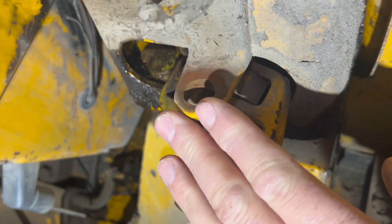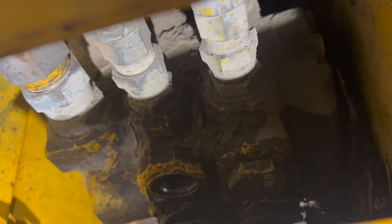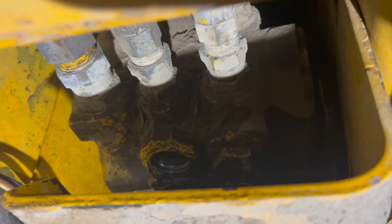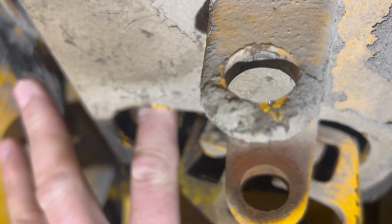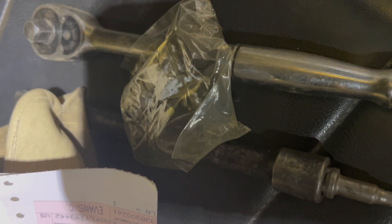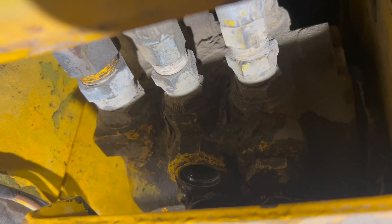Okay, so what I've done: there's the valve stack for the loader controls. I've had to kind of dismantle the linkage for the control system. There are like three bolts underneath there — can't see very well — but three bolts that bolt the stack to this heavy bracket. I just unbolted those three bolts, took this linkage off, and was able to slide the valve stack out without disconnecting any of the hoses. Then I reached through this hole right here and screwed that relief valve in. There's the new relief valve — I'm going to set the phone down, screw that in, and hopefully have the backhoe back in action.